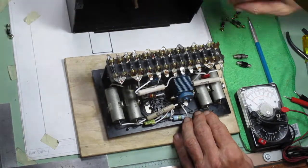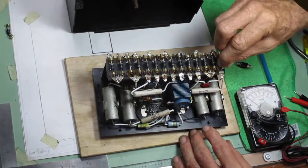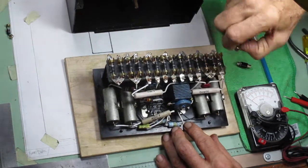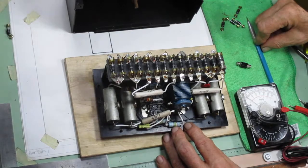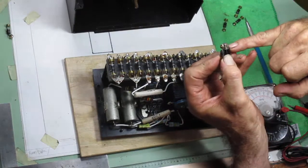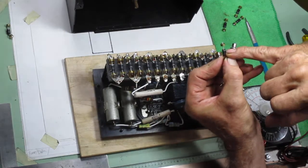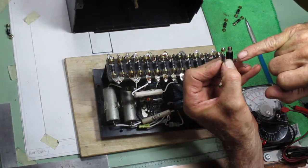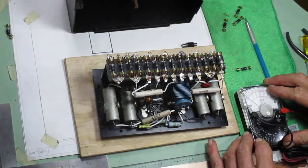The stock diodes only go in one direction because they're polarized — you have to flip it around and it snaps right in. You look at the factory diode and it's got a little notch, and the cheap replacement has a little band — that's the directional indicator. If you're not familiar with diodes, let me check this thing real quick and show you something pretty cool.